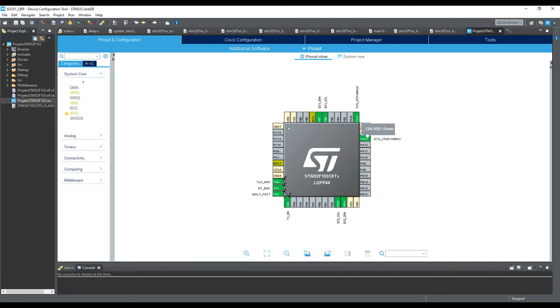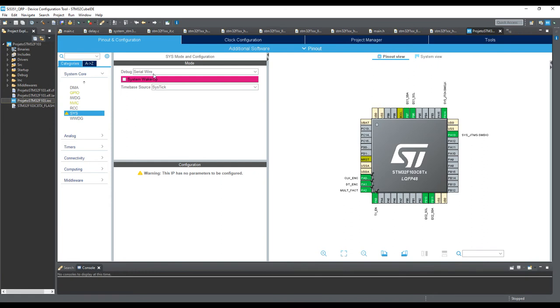Be careful, because if you want to disable the serial wire debug connection, which is very common, you can only connect to the microcontroller again after you record the program. You can only connect again if you provide some way to do that, like pushing the reset push button of the microcontroller, using the ST-Link software to make a flash erase, and releasing the button right after you press the flash erase command. After that you can erase the microcontroller, set the serial wire, and record the microcontroller again.